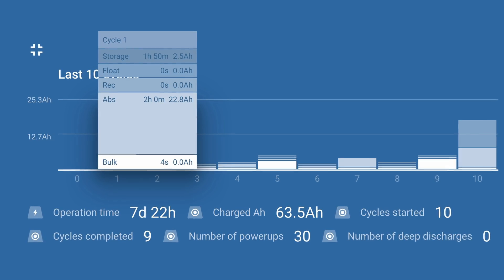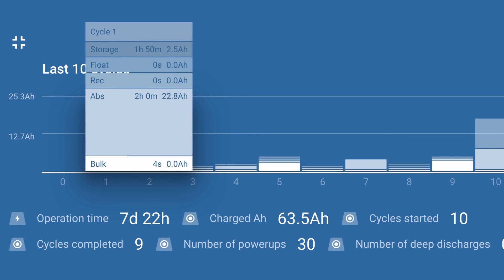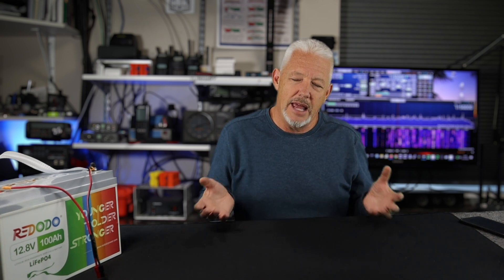For another comparison, when I got back from my road trip, I plugged in my Victron 1217 Bluetooth charger. The reason I like that is it gives me some feedback on my phone and it tracks charging states, so you can see what the last charge cycle did and how much power it took. The nice thing about a more expensive charger like that is you do get different charge modes or cycles.